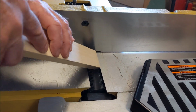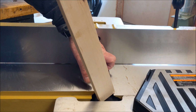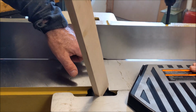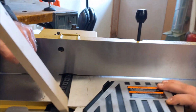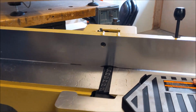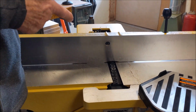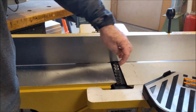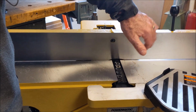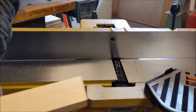Why is it all right to put my finger in here? Because it's disconnected from the electricity altogether. And you could see the number of cutters on there too. It's probably spinning at the same speed, but the engagement is going to be a lot smoother because of the helical knives, the increase in slope, and the number of cutters on there as well, on the disc, on the round part itself. Everybody good to go on that?